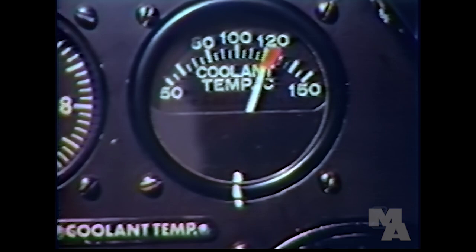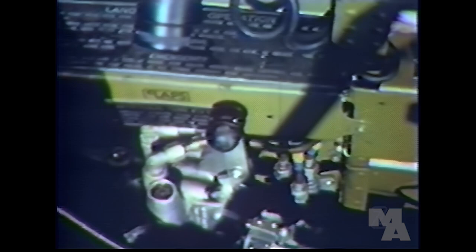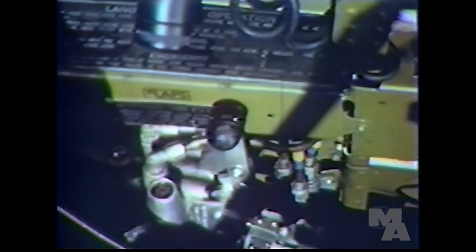The landing gear and wing flaps of the P-40 are raised and lowered by means of hydraulic pressure. This is the flap control right here. To lower the flaps, you push the control handle forward and pull the lower trigger on the control stick.